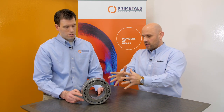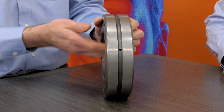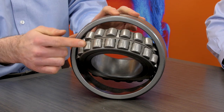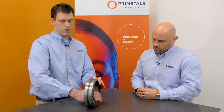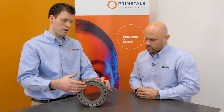So tell me a little bit about what we have here. This is a spherical roller bearing. This is pretty common. They come in all different types of sizes. What's nice about a spherical roller bearing is that they're made to handle misalignment. It's actually a sphere that these rollers ride on, so it allows it to ride misaligned and still handle the radial load.